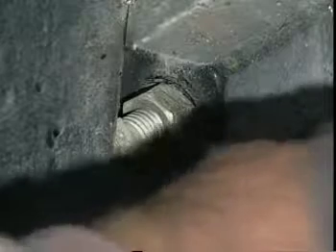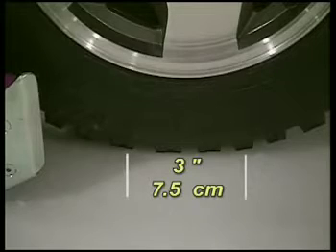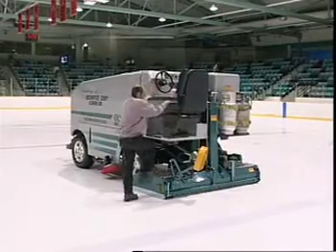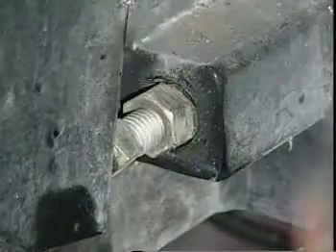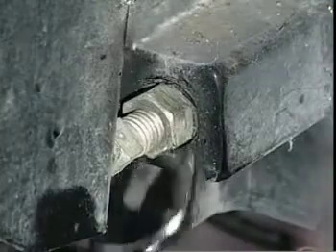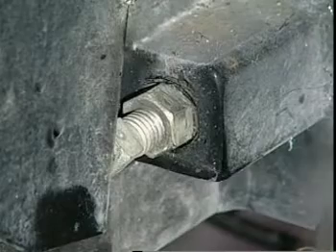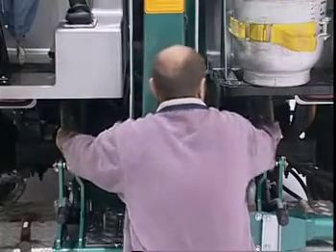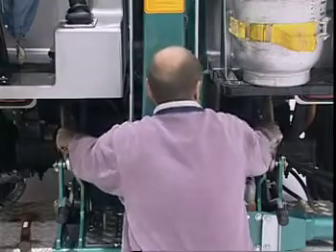Remount the Olympia and lower the conditioner until you have three tire lugs touching the ice. Shut off the Olympia and dismount. Turn the down pressure stop bolts until they are tight against the down stops under the conditioner arms, then tighten the jam nuts. Every time you reset the down pressure, you have to then reset the top link adjustment as shown earlier.